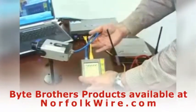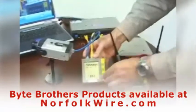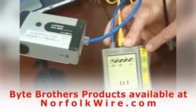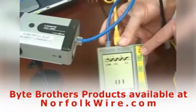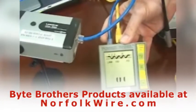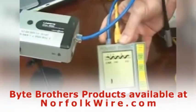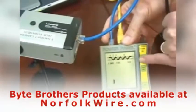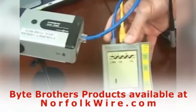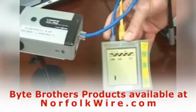I connect in between my switch and the PoE device, and immediately I see that there is a network device and there is power over ethernet available. Going to the network screen, it says it sees a device that is 100 Mbps full duplex on pairs 1, 2, 3, and 6. I also see data is flowing by looking at my dancing data display.